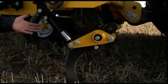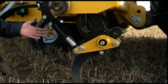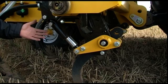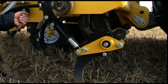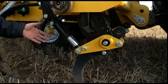There are two stone protection options available on the Hybrid Drill: either shear bolts, or alternatively, as this machine features, a hydraulic stone breakback which is held in the ground at around six hundred kilograms pressure until it hits a stone, trips back, and then kicks back into action straight away.